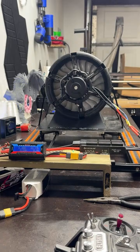realistically, this one is not a direct drive. Obviously, it's a 4-to-1 step up. If I put another stack of gears on there, you're looking at 16-to-1. But right now, with the max RPMs on this motor, we should push 32 to 35,000 RPM, which is about 55 pounds of thrust if you calculate the mass airflow.